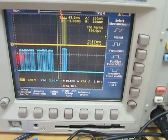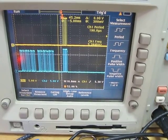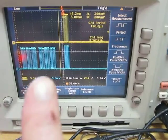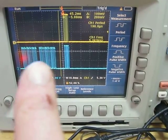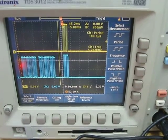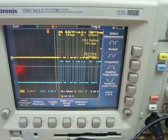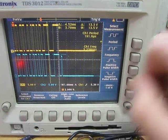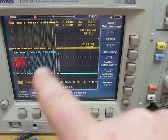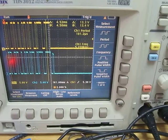Here's the signals I'm sending. On top in yellow is the transmit. On the bottom is the receive — specifically, this side is what the cluster is sending out, and this is what I'm sending out. The interesting part to note is, if we go down to this, you can see there's an extra little blip right there. That's the acknowledgement from the cluster saying, hey, I've received your message and I'm happy with it.